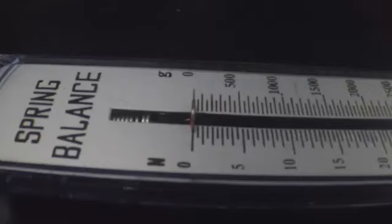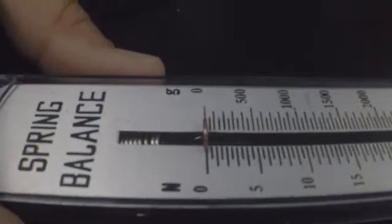I want you to see something while you're watching. Watch the gauge — I'm going to pull the cart and get it started. You should see the gauge go way beyond that five, five and a half we had, and then the moment it starts the cart moving it'll snap back to about five. See that? It takes more friction to get it started, but once it's started it goes back to where it was.